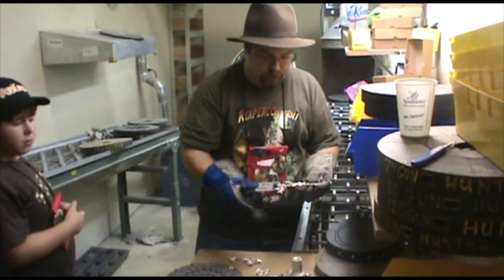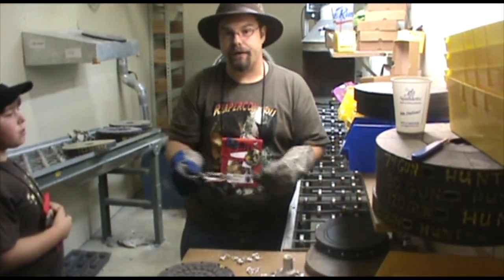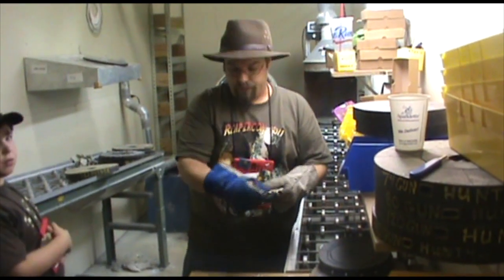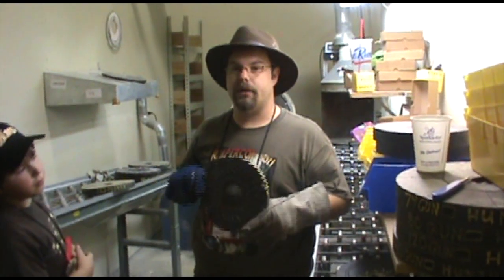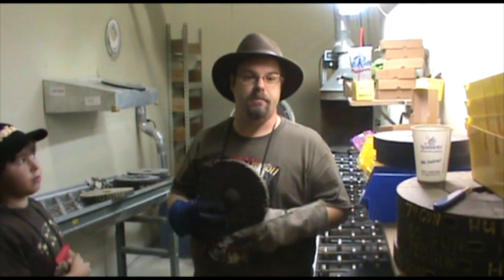Our casters are expected generally to produce one new mold every 45 seconds. Now that will vary. If they're running something like a dragon, it can take 3 to 5 minutes to cool off. If you can see what this is, our little Demon Baby, familiar? Demon Baby probably only takes about 20 seconds. So they can really run 2 or 3 Demon Babies a minute.